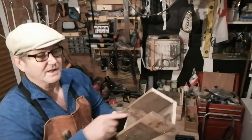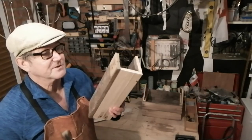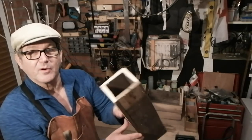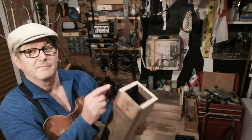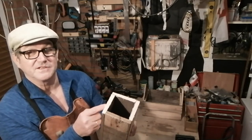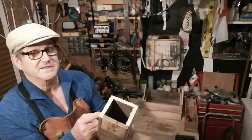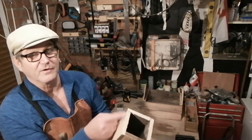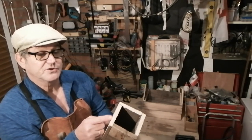I'm going to finish off the last side and then I'll show you the scientific bit, which is making the actual castellations along the top. I'm going to put the castellations on before I attach it to the rest of the church — that will make it easier to do. I'm just going to mark them out with pencil; it doesn't need to be really accurate because from a distance nobody will see it. The way I do it is mark it out to get a perspective, then drill through and use my jigsaw just to square it off.